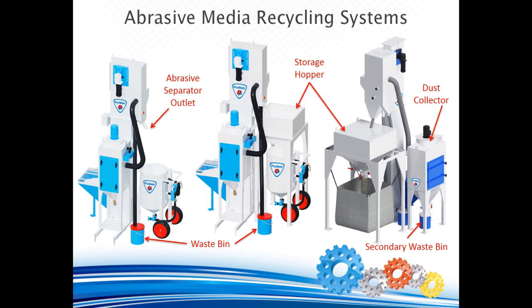The reverse air pulse jet dust collector provides ventilation to the abrasive separator, so good reusable abrasive media can be recycled for reuse, while the removed contaminants are fed to the waste bin. The abrasive separator is adjustable to suit most abrasive types.